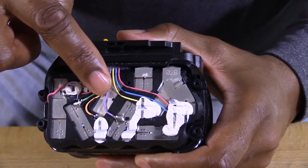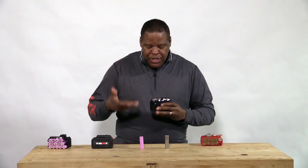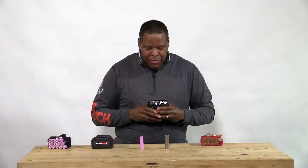Solder is a very impure material and should not be used for maximum power transfer. So, when you use something that is not pure, like solder, to construct and attach components of the battery, you do nothing but add resistance, and when you add resistance, you add heat, and when you add heat, that's bad for the battery, and if you don't have a mechanism to manage that heat and get it away from the battery, you're really just compounding your problem.